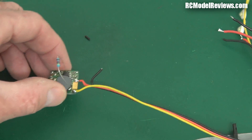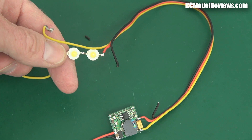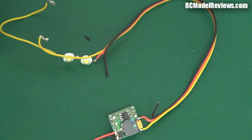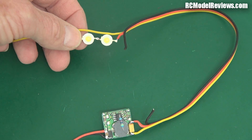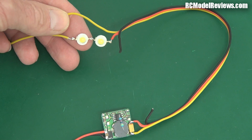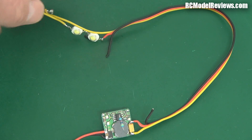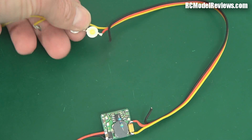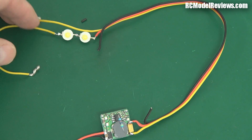What I've done here is I needed a power supply for something a little different. I've got my quadcopter and I wanted to put some bright LEDs on it. Here are some 1-watt LEDs, but these use about 3.3 to 3.4 volts each for maximum brightness. If you put that across a 3-cell LiPo they just go bang. I only wanted to use two of them, so I need to drop the voltage down to about 6.6 to 6.8 volts. I could have done that with a resistor, but then a lot of power is wasted as heat, draining the battery — and I want maximum flight times out of my multi-rotor.